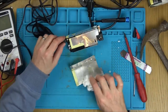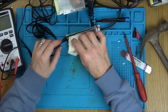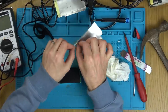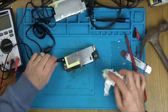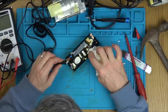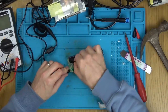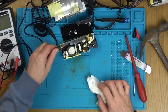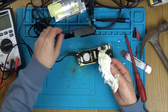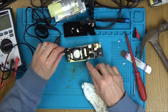I'm really curious what went bang. I didn't realise at the time how much I was sniffing it — I wasn't sure if it was electrolyte from a capacitor or whether something had been spilt on it. Let's measure that big cap. Hold on — has the big cap blown? Would that have caused all this? Yes — look at that big cap, it's bulged out. Can you see it's bulged there?